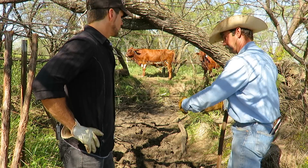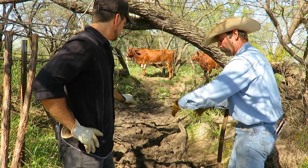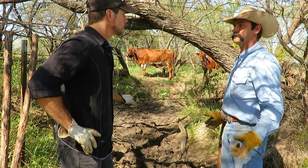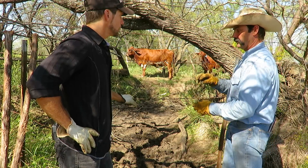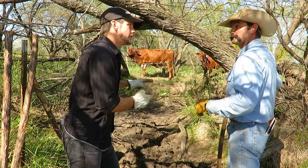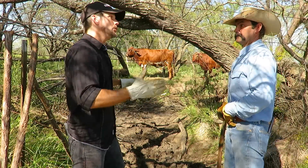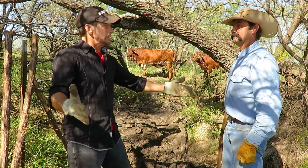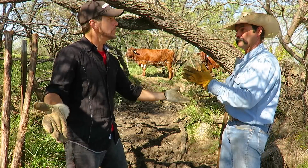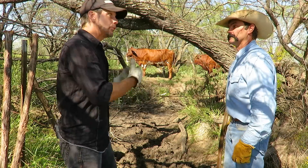In this situation we know the water is coming from the west going east, so we're going to allow it to break loose so you can pull down here without the fence truck — you don't have to load up the fencing truck and come down here and rebuild. You'll have a couple pieces of wire, and we're going to leave some extra wire on the fence when we get through. So you want this fence, during a rainy season or flood, instead of getting stuck on a fence that won't give, to make its own semi-permanent breakaway gate — not ruined, but something you can pick back up after the water recedes and put it back together without redoing an entire fence.